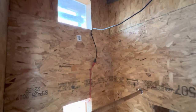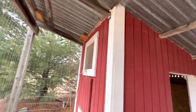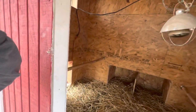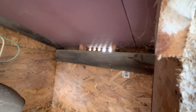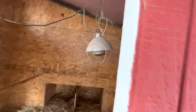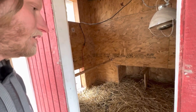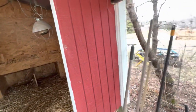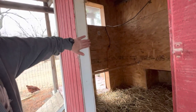There's another window — basically just a piece of plexiglass pinched between the wood — super cheap if you want to do a budget window. It doesn't open, but it provides light and some sunlight for them, facing south, so in winter they get a little light in there. I also drilled five permanent vent holes that are always open — you always need good venting in chicken coops. They get really dusty, and you never want to fully seal them in — it's bad for them. Between the open window, door, and vent holes, it stays well ventilated.